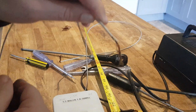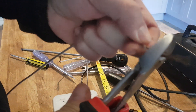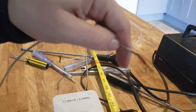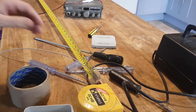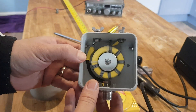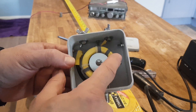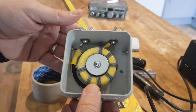I don't like using steel cable because it rusts, but come on — it's only for a bit of fun. We've got a decent bit of wire cutter here which actually struggles to cut this steel cable. So we've taped the one end of the wire. I've taken the lid off the balun — that's a good quality balun. How many winds? Seven winds. Nice good quality ferrite ring.